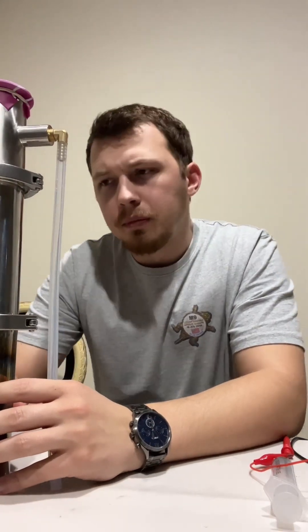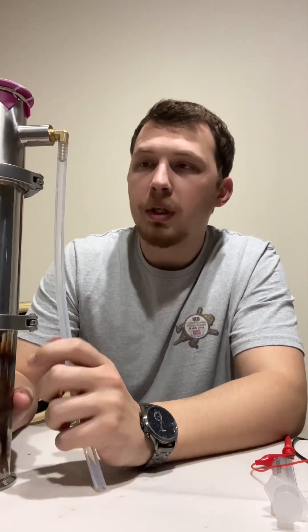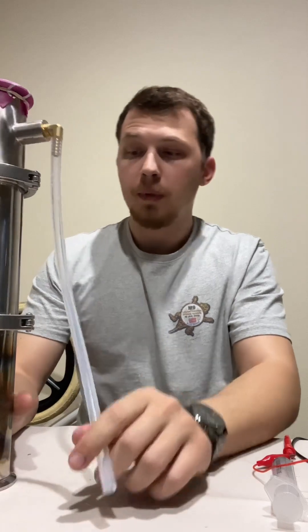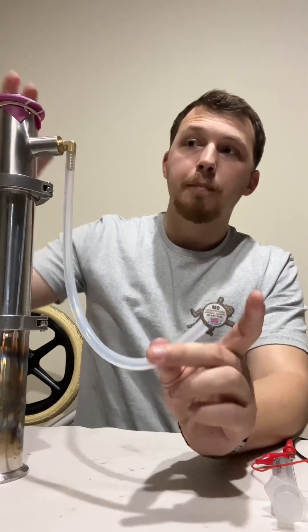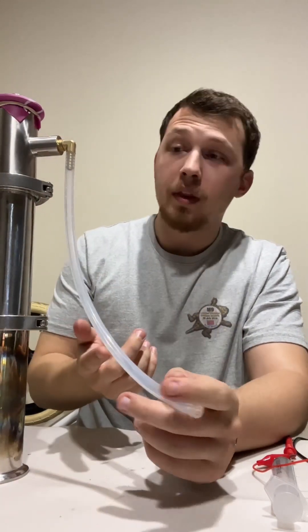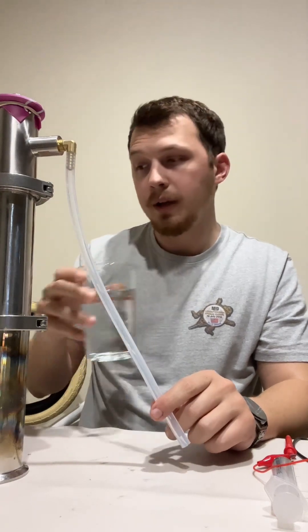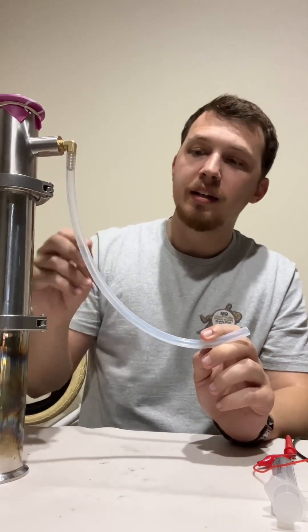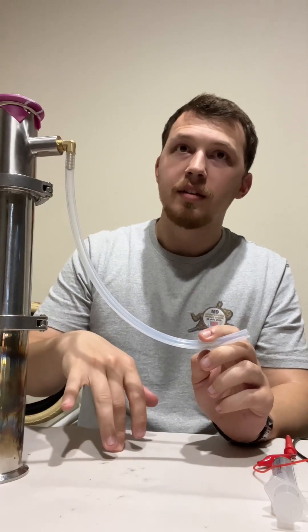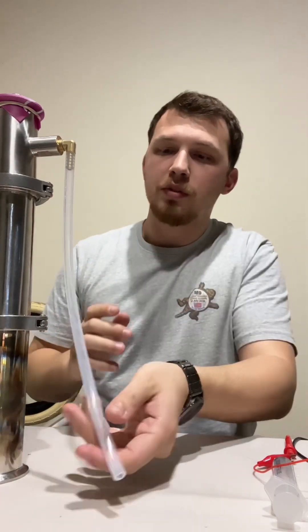The reason I added this tube is because I did a test recently where I had a six-foot six-inch, one-eighth-inch tube and used that as my resonator tube — basically making the entire engine longer by six feet six inches. That obviously worked, both out of water and in water. The six-foot six-inch tube has a total interior space of 0.817 cubic inches — a very long but very tiny tube, less than one cubic inch of space.